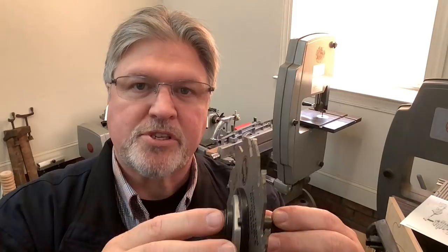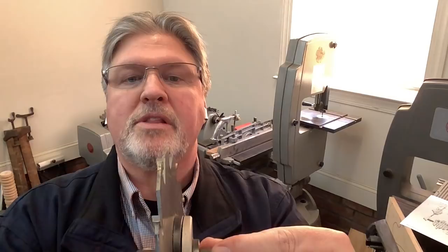So even though the blade is not sweeping back and forth, if you take any flat blade and tilt it, it's going to have the effect in the cut of sweeping. So the bottom of your dado, the bottom of your groove, will have a bit of a concave shape to it. Now, what Vermont American did that was kind of clever is they took this thing and set it at its furthest setting, which I believe is 13/16. It is 13/16.